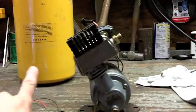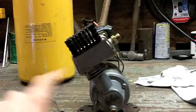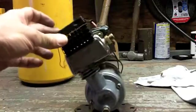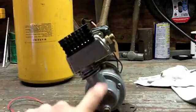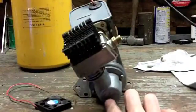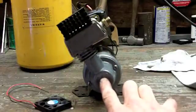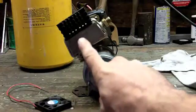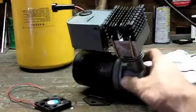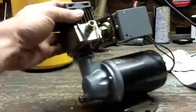I'm going to see how long it takes to fill the tank from dead empty, then use my infrared thermal gun to see how hot this gets, and then run it with the fan to see if it actually makes a difference. I've also got fresh oil in here — this compressor calls for ATF or a light grade oil like ATF for service air. If you're using it for a compressed air system in a motorhome, they recommend mineral oil so it doesn't contaminate your water supply. So: fresh oil, fresh diaphragm, a super sick head with a little air-cooled fan. Awesome.